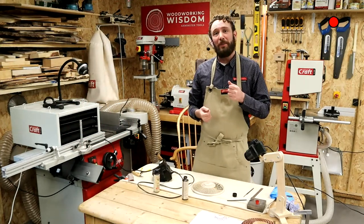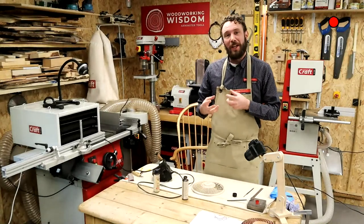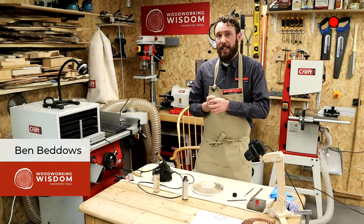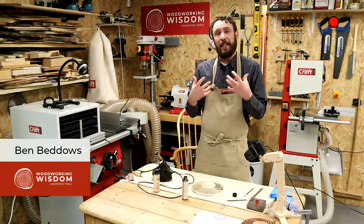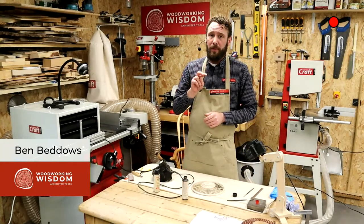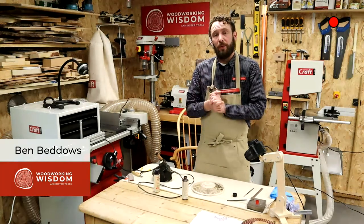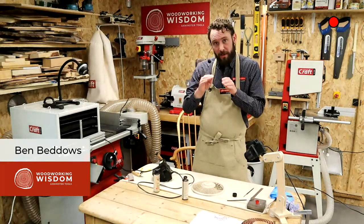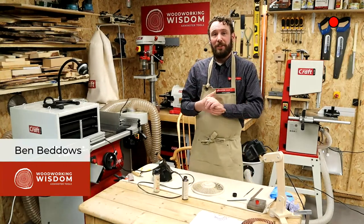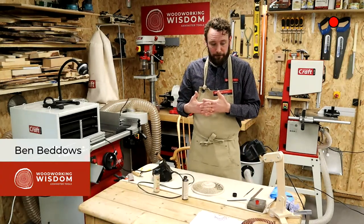Today we are carrying on with a basket weave illusion project, a lovely little thing that Colwin got started yesterday. What it is basically is a bowl, or it could be any kind of turned item. And he's used a fluting parting tool or a bead forming tool to create lots of little rounds on the bowl, which we can then divide and colour to make it look like a woven basket.